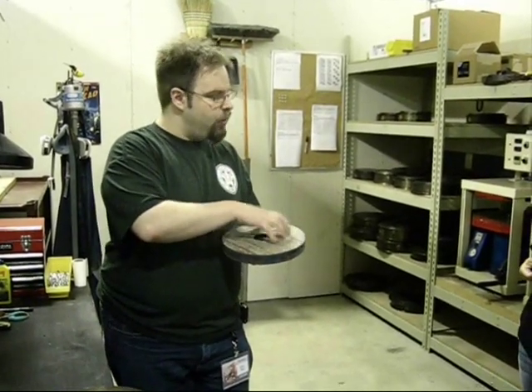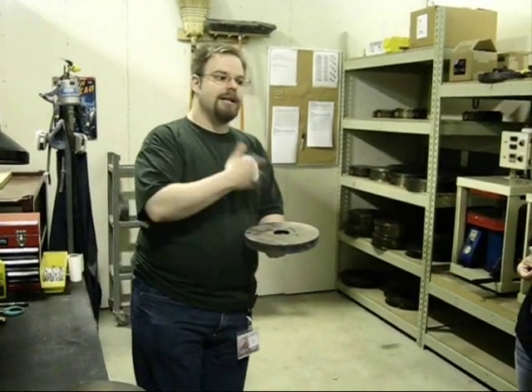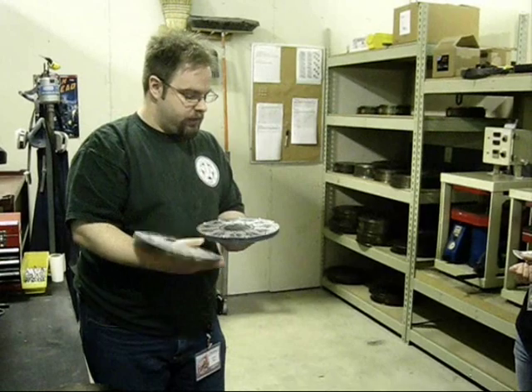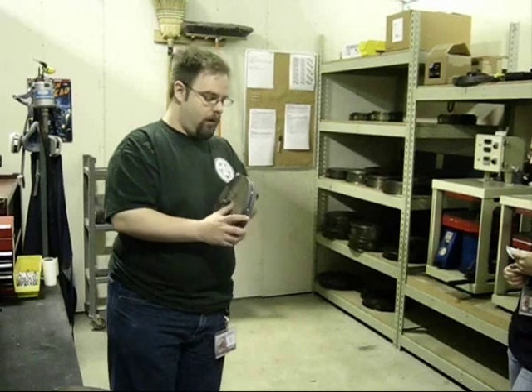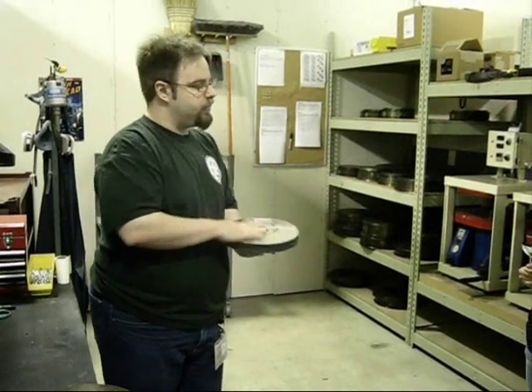The newspaper keeps the mold from creating a vacuum. Inside casting, we're going to put it inside a spin caster. We put a metal steel plate on top of it and there's a hydraulic press that squeezes the two halves together to prevent the metal from flowing out where it's not supposed to. If we didn't have the paper, it might create a vacuum and then we wouldn't be able to lift that steel plate back off. The channels on the bottom do the same function as the newspaper on the top.